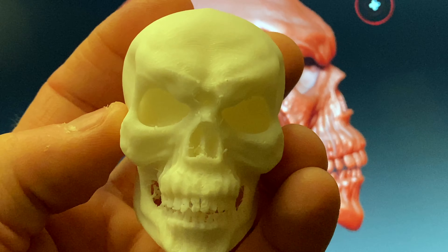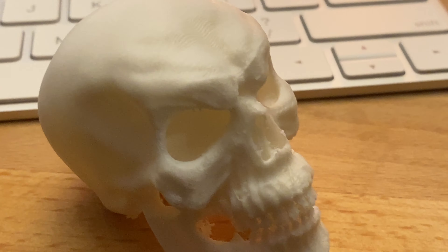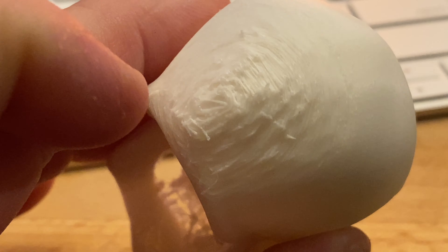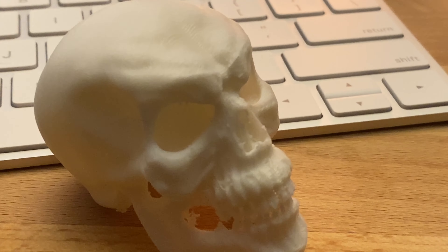Overall I'm really impressed. I am getting a little bit of the striations which is indicative of a filament printer, but if you look it all disappears through here. Right here I need to adjust the leveling a little bit better on the deck. Overall I think it turned out really well, considering I still haven't gotten everything perfectly dialed in and that skull print was on the normal setting. I didn't put it on the highest or most micron-level detail setting. I'm hyper impressed — I had printed on a $2,500 printer in 2019 on the highest settings and honestly it wasn't even close to this.